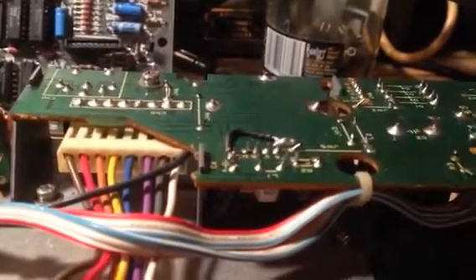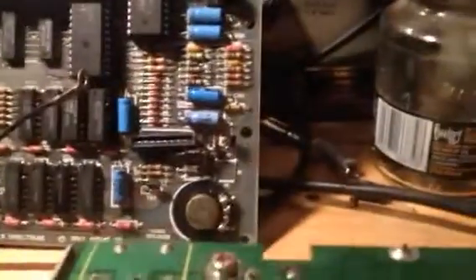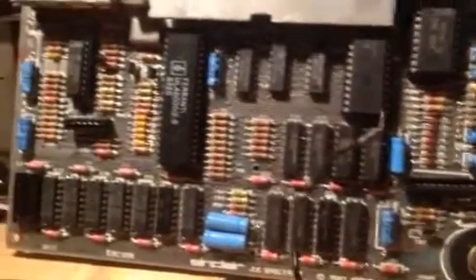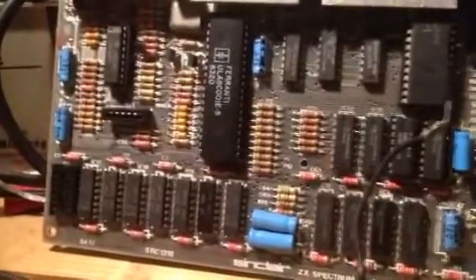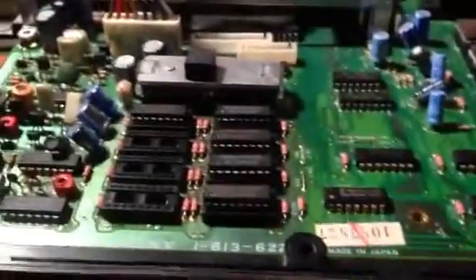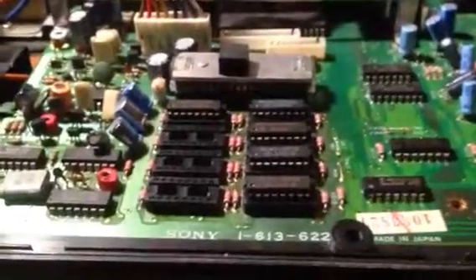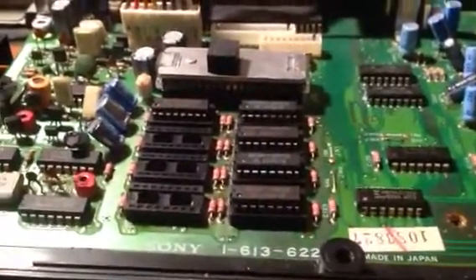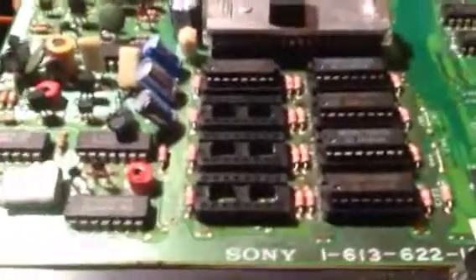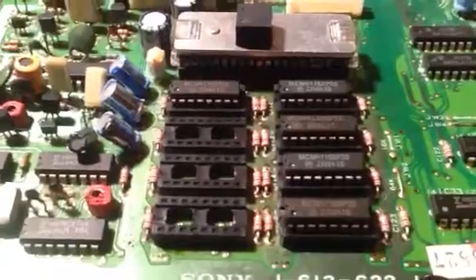You can hardly ever see it in computers. Even look at this - this is a humble ZX Spectrum, 48K ZX Spectrum board, and that's made out of fiberglass with copper on fiberglass. You know these boards - they're horrible to work on and you do lift tracks occasionally on them. But that is about 100 times better to work on than this thing. And this is made by Sony - you'd expect better from Sony, even in the early 1980s. I had a real nightmare of a job to change those few ICs there.